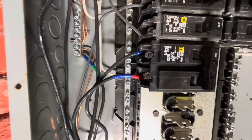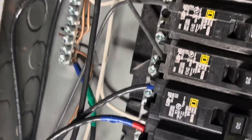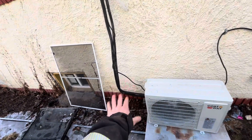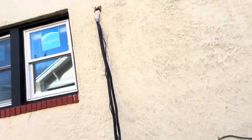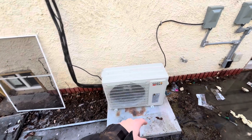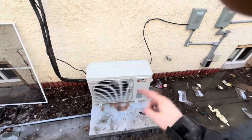Here's the panel - here's the 240/250-volt breaker, hot and hot, and then you tie in the ground right there. Those three wires run outside and that's everything. We're going upstairs for one last look. Outside: you're supposed to run a track up the wall to cover all the line set, and wrap it with that white insulation tape, but you guys already know how to do that. Like, subscribe, and check out my other informational videos. That's how you install a Costway mini-split 240-volt - thank you, peace.